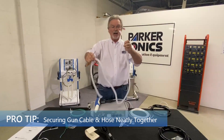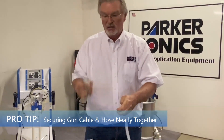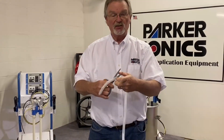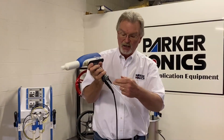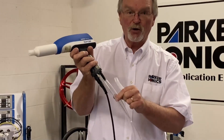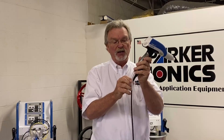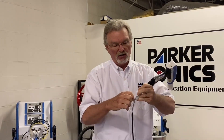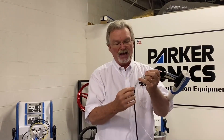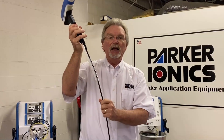You wonder what the spiral wrap is all about? Take the spiral wrap and cut it into roughly 6-inch sections. I've connected up all the hoses and cables to the gun itself — you have your gun cable, your cleansing air hose (6mm), and your powder hose (10mm). To manage all this length of hose and cable: take the spiral wrap, do a wrap around the powder hose, and tie together all three of these lines — the powder hose, the cleansing air, and the gun cable — like this.